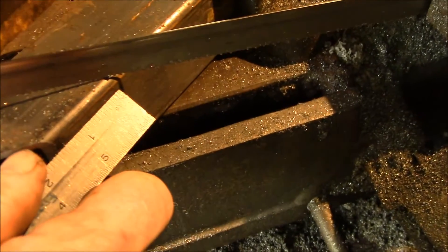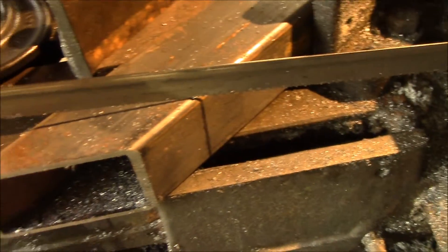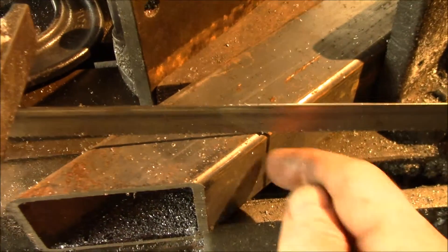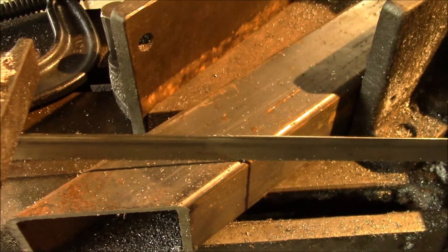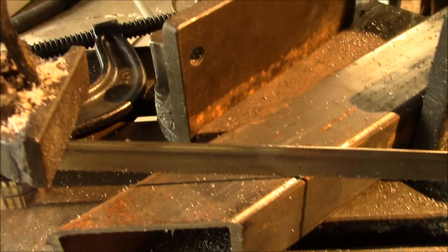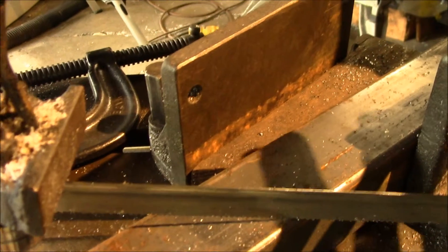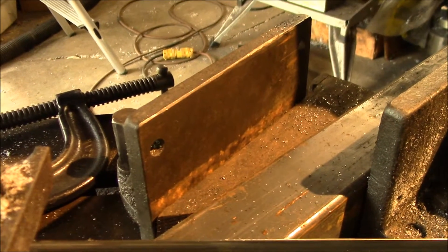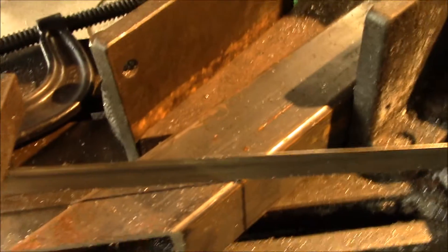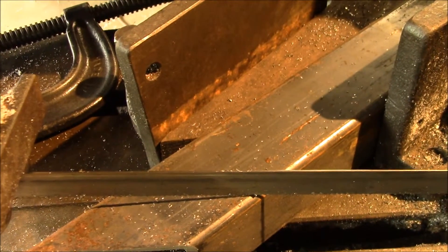So I just have to measure essentially from that cut edge to the shadow line — that works really well. It's kind of like the nicer saws and such have lasers built in that shine where the saw blade is going to go, but this works pretty much the same. The CFL bulb I had in there never really gave a shadow at all because the light was so diffuse, there was really no sharp shadow. But that works really well.